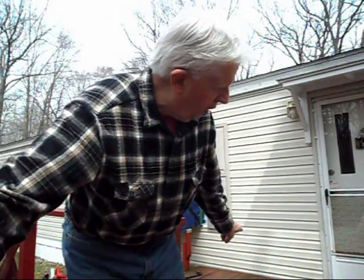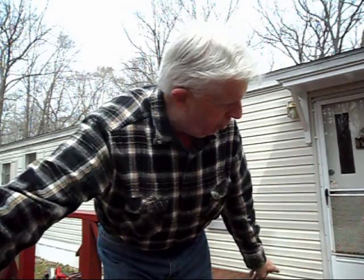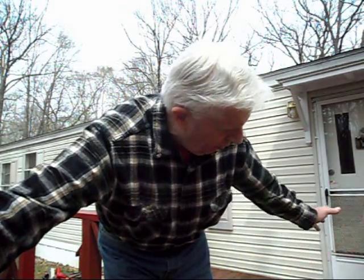This is Douglas fir. It lasted, you might as well say 25 years. It should have been replaced at the 25-year mark, but it lasted 28 years. It's going to outlast me. I'll be long dead before 25 years is up. So I'm going to put Douglas fir down here. At least it's stable. And even though you can't get oil-based wood preservative anymore, I'm going to just put that milk stuff on there. But I will use pressure-treated in the 2x8 stringers, so I don't have to worry about them going bad.